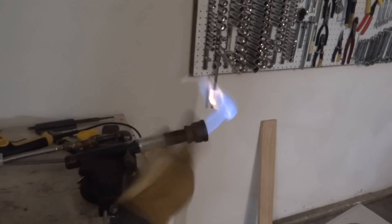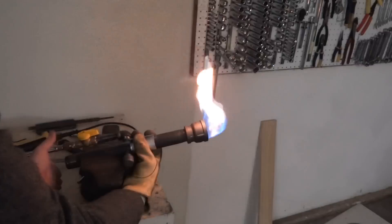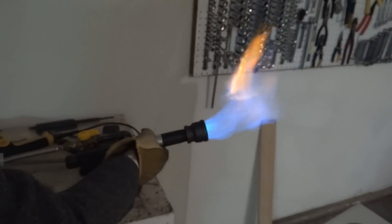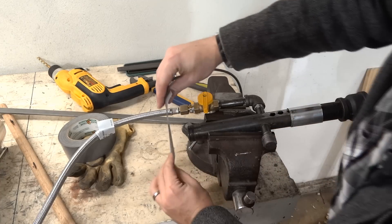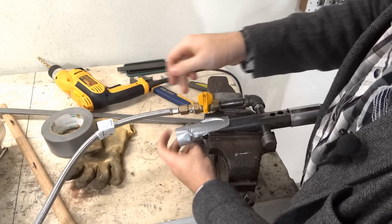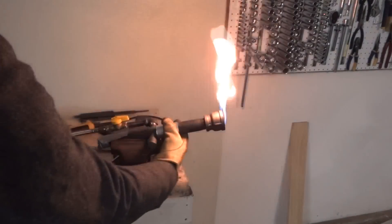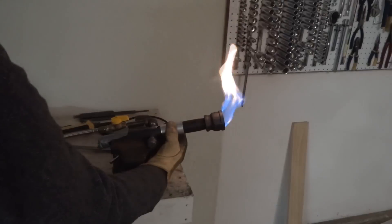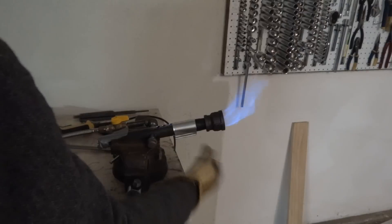Now if we open up the holes — see the yellow flame, yellow is rich. It's back in the pipe again. Let's see if I crank it up. There we go, whoa, big flame. Slowly — that's back in the pipe. There, that's more of a neutral — dang it, back in the pipe. Why does it keep doing that? No air is getting in the back at all. The flame is coming out the end and it's very rich — it doesn't get any oxygen until it comes out here. One hole open — less rich. Another hole open — that looks much better, catching up to neutral but still yellow, so still rich. And it's back in the pipe.